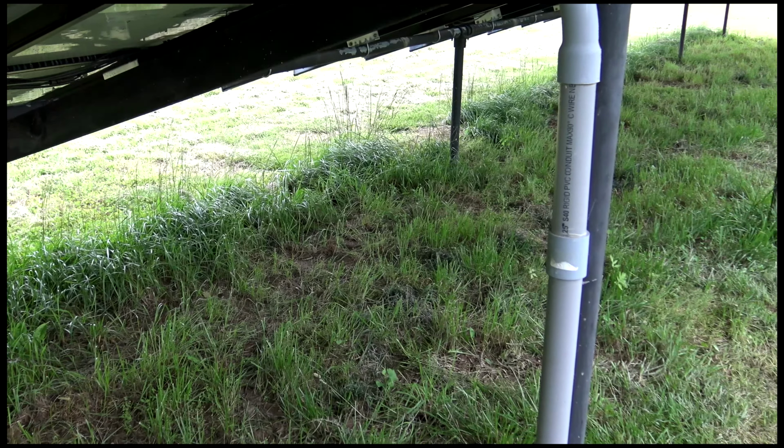And then I got the idea that I would like to do a test to see if I could put the inverters inside and convert these 4 service wires into 2 DC loops, which seemed like a stretch because it's like 500 to 600 feet away. So that's a long way to shoot the DC. And it's not that the DC is a problem, it's the signals that are transmitted through that wire that come from these DC to DC converters that SolarEdge uses. So I wasn't sure if that was even going to work, and I didn't think about the idea of doing it until after we had already trenched in this wire. But anyway, I did give it a go, and it worked great.